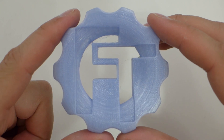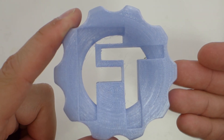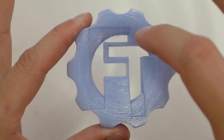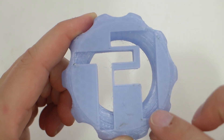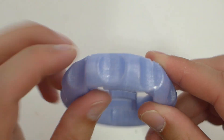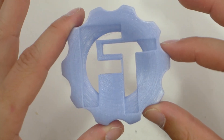Up next we have Mold Lay by Lay Filaments. This is pretty cool — instead of carving something out of soap, wax, or foam, you can just 3D print it and put it in sand, cover it over, pour your metal in, and it will melt this out, leaving you with a metal casting. I can't do that, so simply at the printability of this filament, it turned out great. First layers over the support were okay, not the best, but you won't see that detail in a metal casting anyway. Side walls were nice and smooth, all details were captured, and it printed extremely easily. I was very impressed.